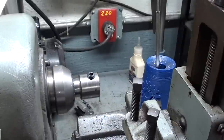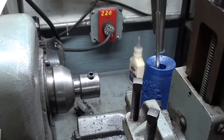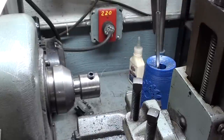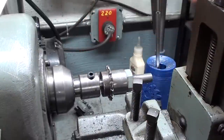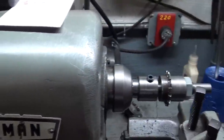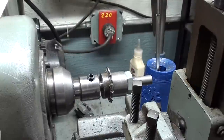Let's start the setup here on the Atlas Craftsman 12-inch lathe. I've already got the holder here in the spindle with a thread protector — this is a half-inch bore, which you cannot see, but it looks very similar to this, only it is a number three Morse taper, so it fits directly into the spindle. Now I will take my homemade arbor and line up this flat with this set screw and tighten it down securely. There is also a drawbar at the end — just a piece of threaded rod — that will pull that cutter into the headstock taper, and there's just no chance of it working its way out. Don't take any chances.